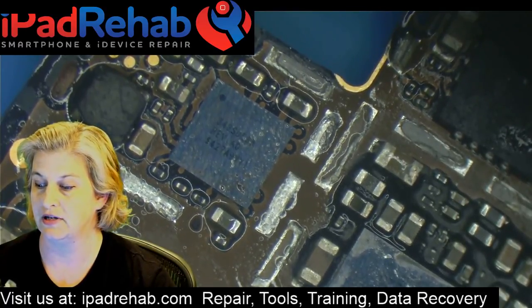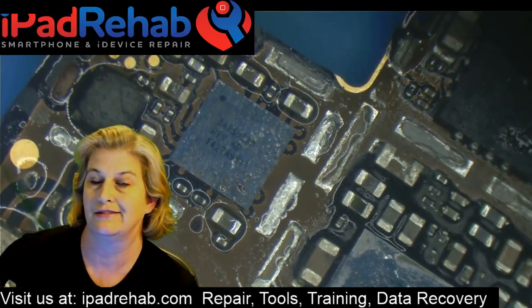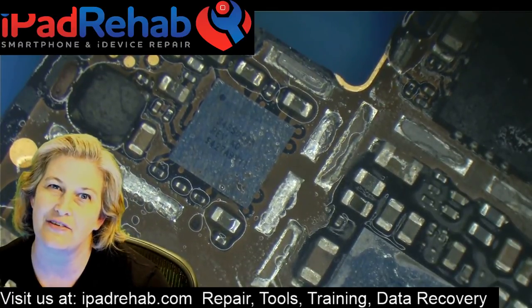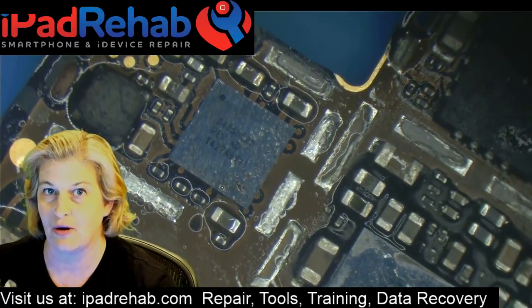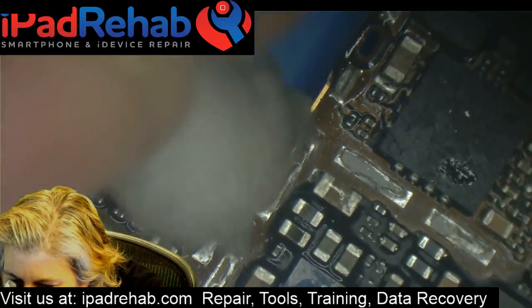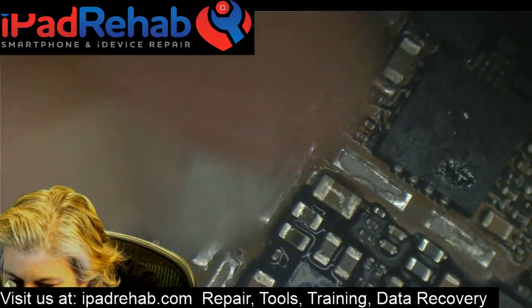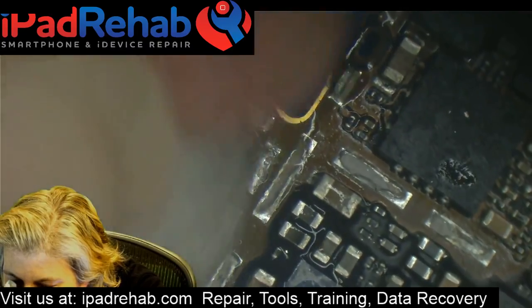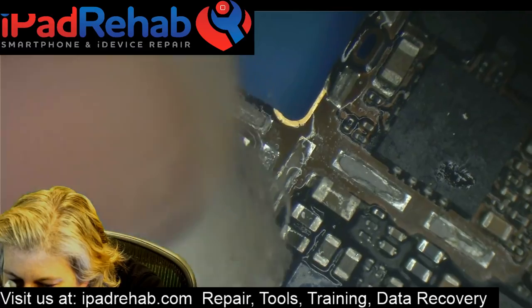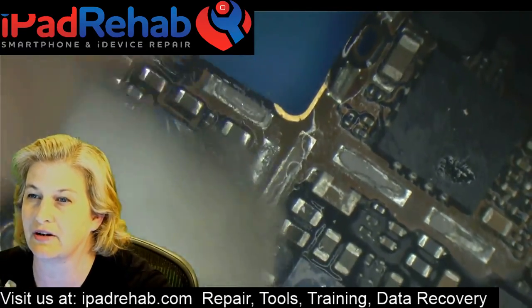Why are we doing that? Because we have water damage in the area of the chip. We have evidence of electrical damage right in the area of the chip. And there's not a whole lot of other obvious damage. So our physical and electrical presentation lines up with, let's just see what happens if we replace this Nimbus. So we're replacing our water-damaged microwave Nimbus with a slightly less water-damaged Nimbus. Ideally, we would get a new one. And we may still, if we end up not having to go down the rabbit hole on this one a little bit. All right, let's see.